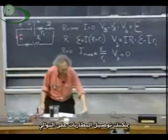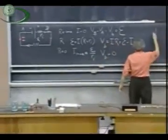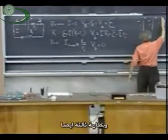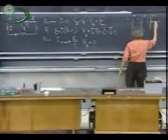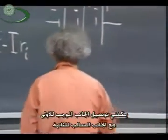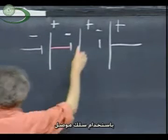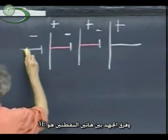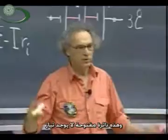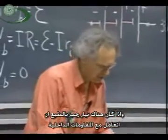You can put batteries in series, and thereby get a higher potential difference. This is the negative side and this is the positive. I have an independent one — negative, positive — and an independent one — negative, positive — each one with an EMF E. And I can connect the positive side of one with the negative side of the other, just a conducting wire, and the positive side of this with the negative side of the other, and now the potential difference between these two points is 3E, open circuit. If I draw a current, then of course I have to deal again with the internal resistance.